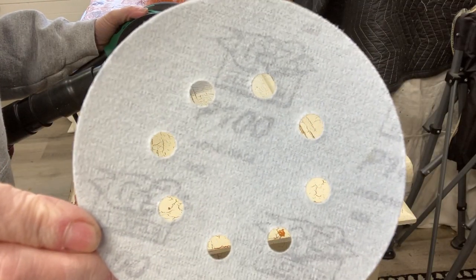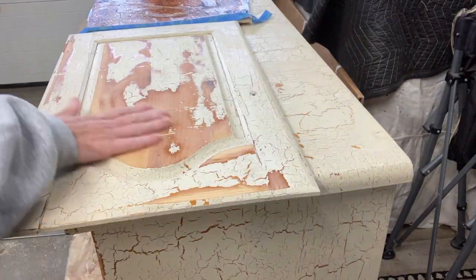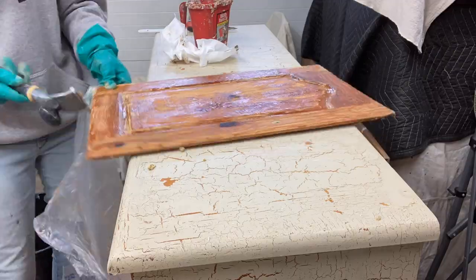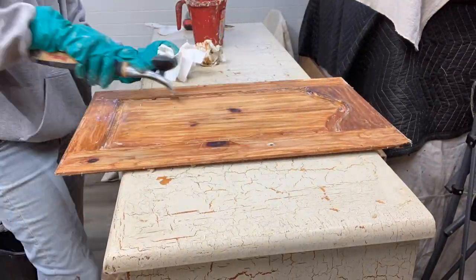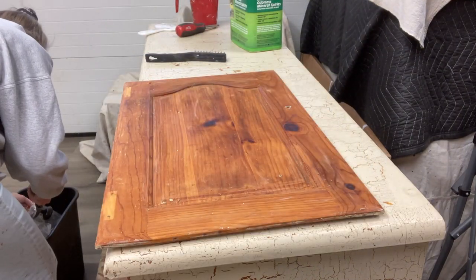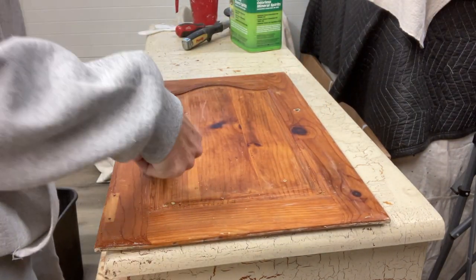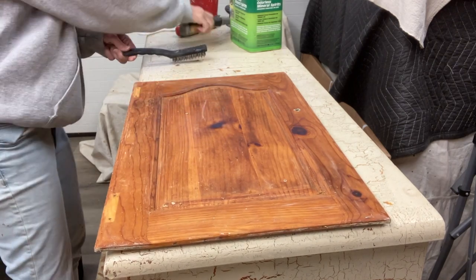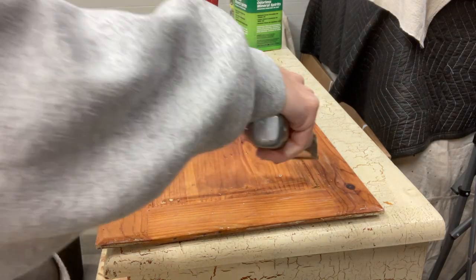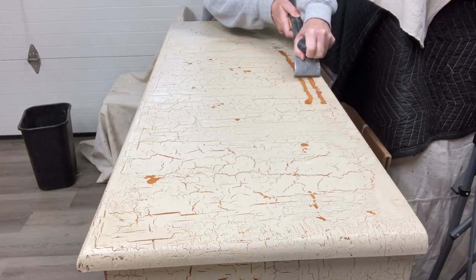Because this is pine, I'm going to go with 100 grit sandpaper. I'm afraid that 80 or 60 grit would be too rough. I'm stripping these doors, but in the end it was a waste of time because I decided not to use them — I wanted to show you the process though. I started with sanding, then scraping, then I decided to put stripper on, and I'm using a carbide scraper to get off the last bits.